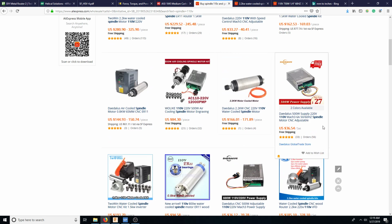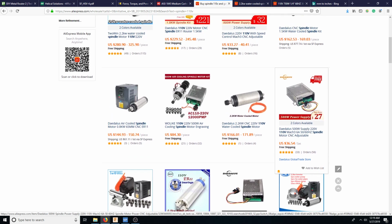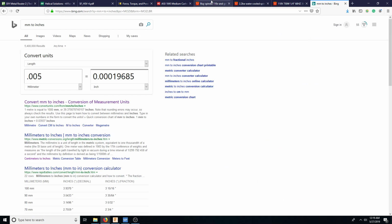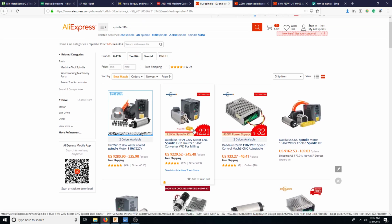you'll see that they also have way more run out. They'll have like 0.01 millimeters. So they'll have double this. It's like 4/10 of run out, which is almost half of what we're supposed to have.